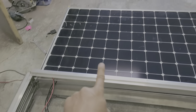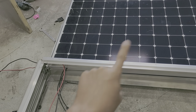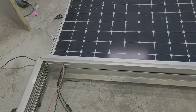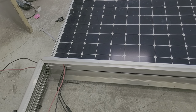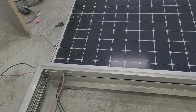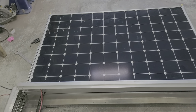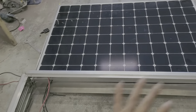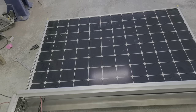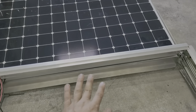So we're going back to glass panels. We want 900 watts — up from 180, which barely hit 100 watts. Then 500 watts of flexible panels deteriorated down to giving maybe 60 watts. Now these I've had sitting outside and they consistently give me 800 watts even flat, sitting in the grass. So I'm hoping even 700 watts would be awesome most days.